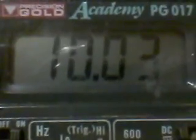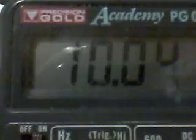Anyway, just to validate that, at the moment the supercapacitors and the circuit board obviously consume power as well. If I go to our main power supply, it's reading about 520 milliamps, but if I disconnect the driver circuit, which is when I knock the wire like this, it drops back by 210 milliamps. Let's do it again. So if you look, it's about 200 milliamps. So it's about the same.